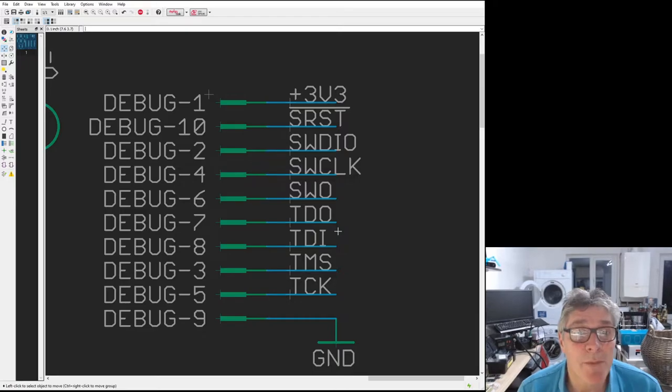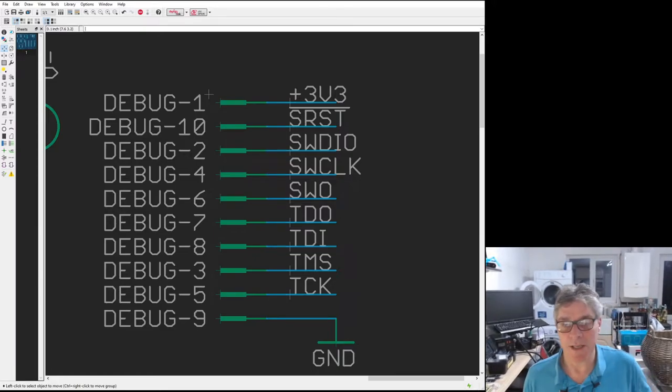So if you want to debug both the STM32 and the ECP5 concurrently, you've got a problem, Houston, because it's one or t'other. So I expose them separately here, so I'm not following the standard overlapping connections, because I want to be able to debug these separately. Now, what that may mean temporarily is using two JTAGs,